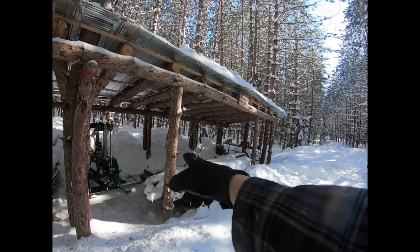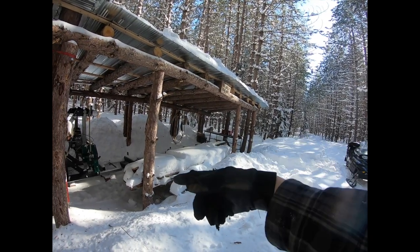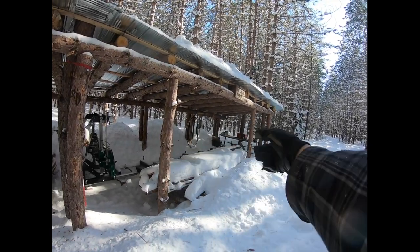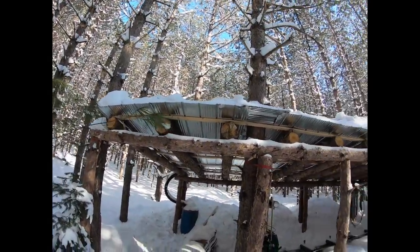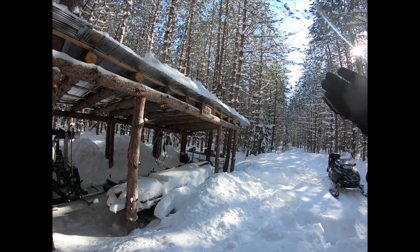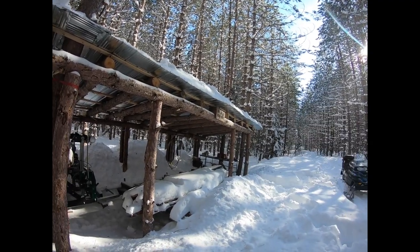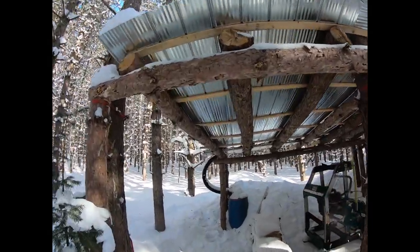These two posts I can move in the summertime - that one in particular I move over a few feet to give me a good 12-foot opening to roll logs into the mill. But in the winter time I move that post further over so that the gap between posts isn't as great. If I weren't going to move the snow from the roof, I'd be more concerned about the spanning, but by coming out and moving the snow regularly and double-checking for excess load, I feel quite confident this setup would suffice.